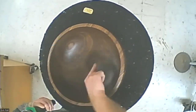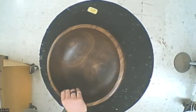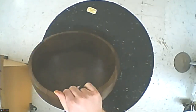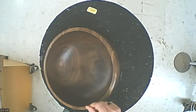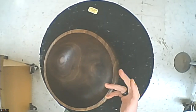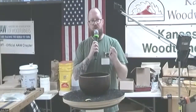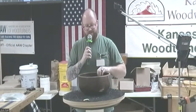There was another crack here and one on this side from drying, and I could feel I wasn't quite at the right thickness there. Instead of using epoxy on this one, I used some little dowels to make little keys — a Dutchman-type idea. I drill a 3/8-inch hole, use a 3/8-inch dowel, glue that in there, and it's worked really well. This one was too thin for epoxy, but the glue holds it in place. The nice thing about wood glue these days is it's stronger than the wood, so even with a round dowel you don't need the actual butterfly shape for a mechanical connection — the wood glue is strong enough to hold it in place.